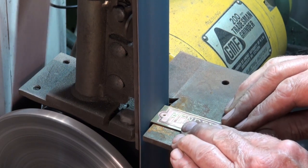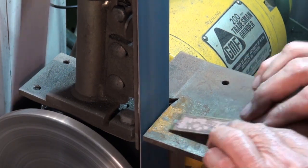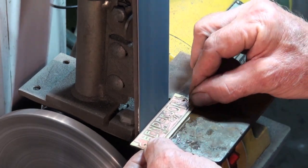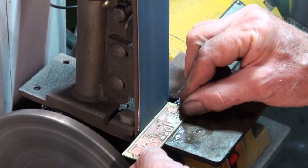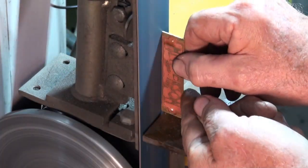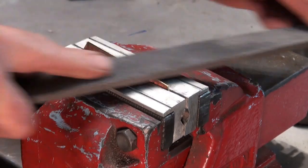Cutting the plate to its finished profile was done using a combination of the belt linisher and just hand files in the vise. Getting the little rounds on the ends correct is not easy, and it's a bit that everyone looks at, and if you get them wrong, it sticks out a mile.